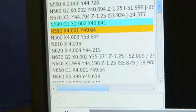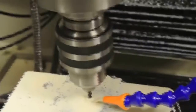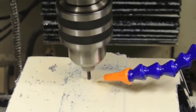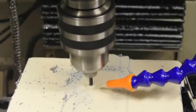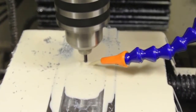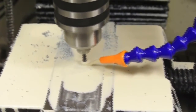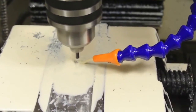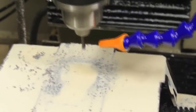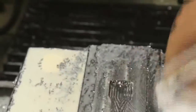I use SprutCAM for the CAM programming. One thing the eagle eye will have spotted is that I'm using a drill chuck for holding an end mill — it's really not recommended practice. However, I didn't have the available collet for this cutter. It's a four millimetre cutter and I just haven't got the right collets. I will be buying some. And that's the job finished. The profile looks pretty good — about two and a half millimetres deep — just what I need for gripping the components.